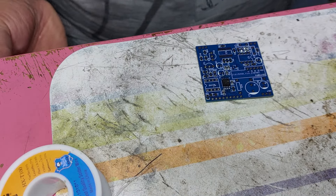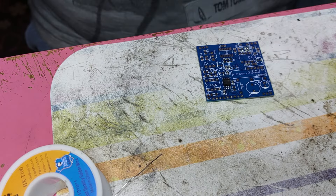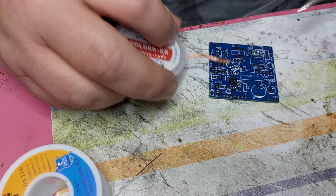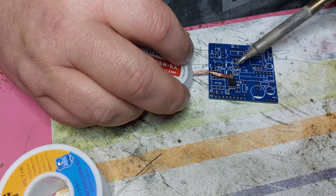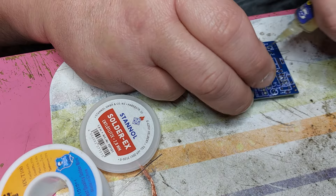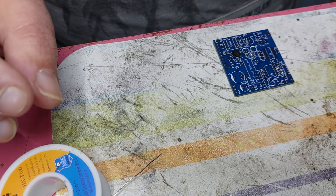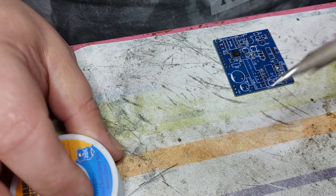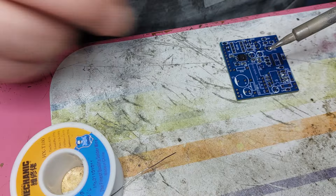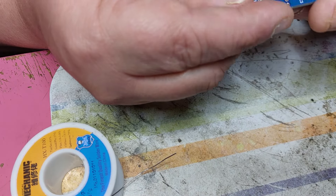Hopefully - actually this doesn't look very good here. I'm going to remove a little bit of solder - this is probably some little bit of the alloy that remained here. So I just use the solder wick - if you're not happy with your job or there's too much solder, you can use the solder wick to remove some solder. Cool. And now I'm going to add a bit more flux, and add some solder again - don't need much, a little bit on the iron. And it looks much better now.